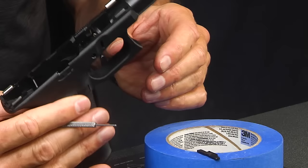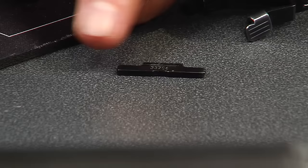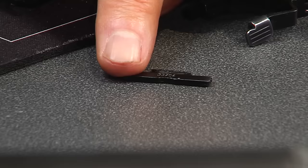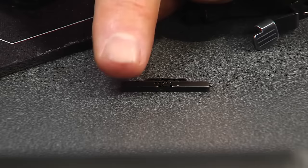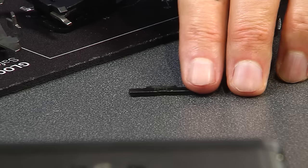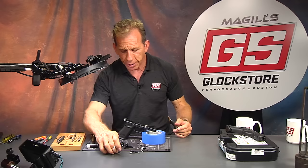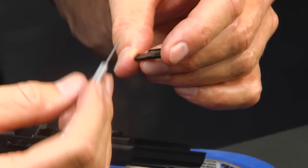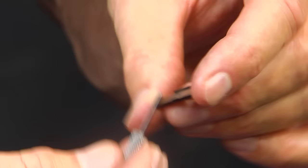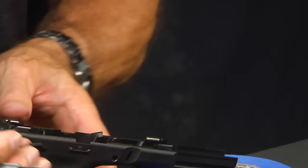The factory slide lock is stamped — if you see how it sits and push on the side, see how it lifts up because one side is bowed. It's not a flat piece, and because of that it has less accuracy because it doesn't lock up in the same place every time. We have a solution: our precision extended slide lock, now available in Gen 5. The notch in the Gen 5 version is a little larger to accept the coil spring versus the small notch that accepted the leaf spring in earlier generations.